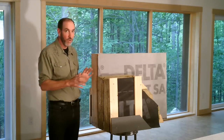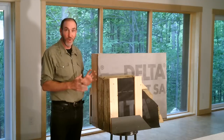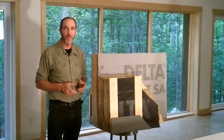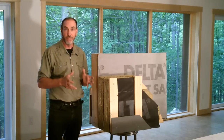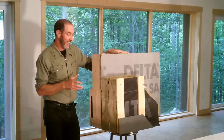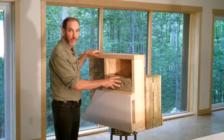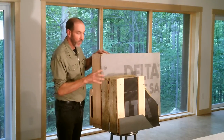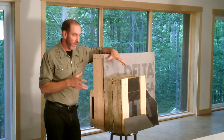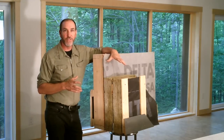We're not saying this is the only way or the best way to build a wall, but it works. We'll explain how it works so you can design your own walls, knowing the fundamental rules to make sure they're going to perform properly and last. You'll notice there's a lot of insulation going on here. We have a normal stud frame wall with batts in the wall cavities, but the majority of our insulation is outside — eight inches of Roxul comfort board. The true R-value of this wall, factoring in all the studs, is about R47.